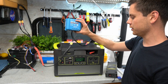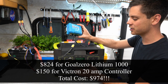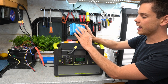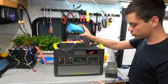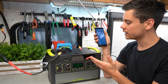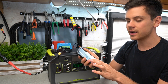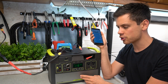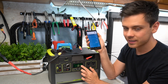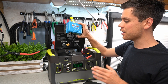This took just a couple minutes to build. The Goal Zero was on sale for $820 during their Memorial Day weekend sale, and the Victron was $150 — so under $1,000 for a lithium battery system with great input and output. After passing my final full-charge test, what I love about using an external solar charge controller like the Victron is the ability to set a lower upper voltage limit. I charge to 12.5 volts absorption instead of 12.6, landing at 92% state of charge, which extends battery cycle life significantly.